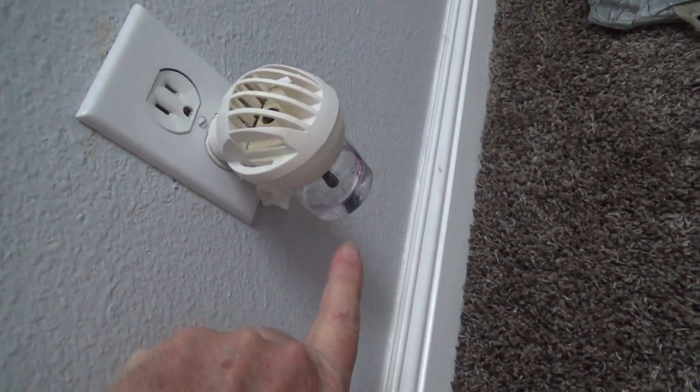There's even a strip gauge on here. You might think, how far do I strip this — like if I'm going to push it in the back? Let's get the thinner wire out here. Let's say we're going to put this on a 15 amp circuit using the 14 gauge wire. Is this long enough to get in there far enough?